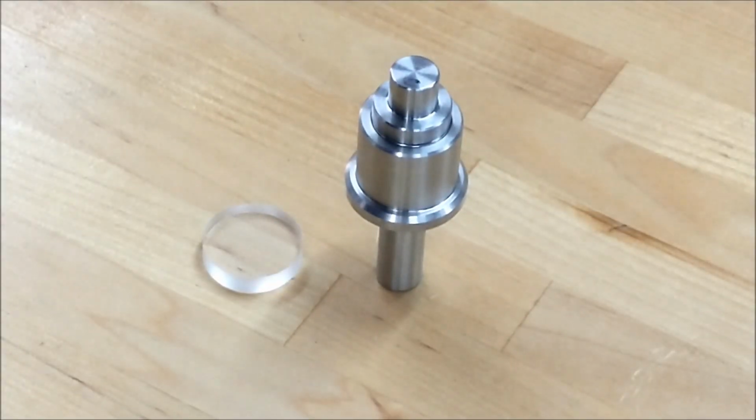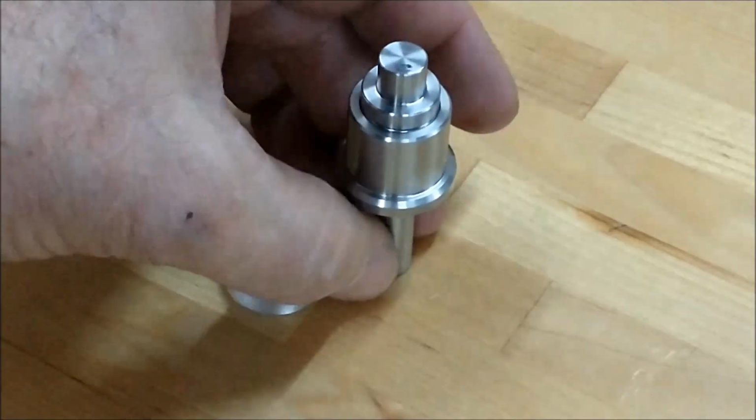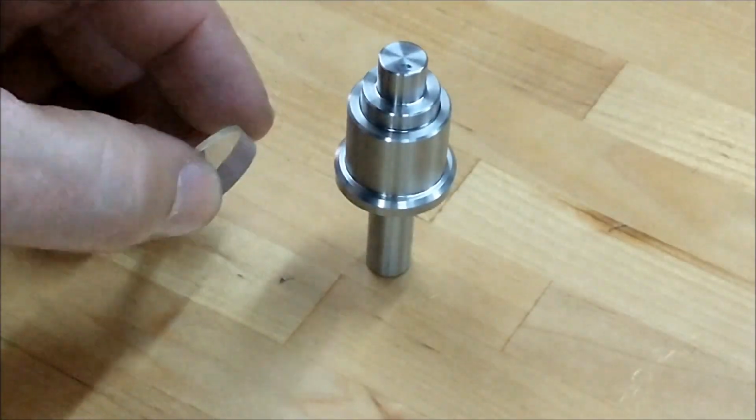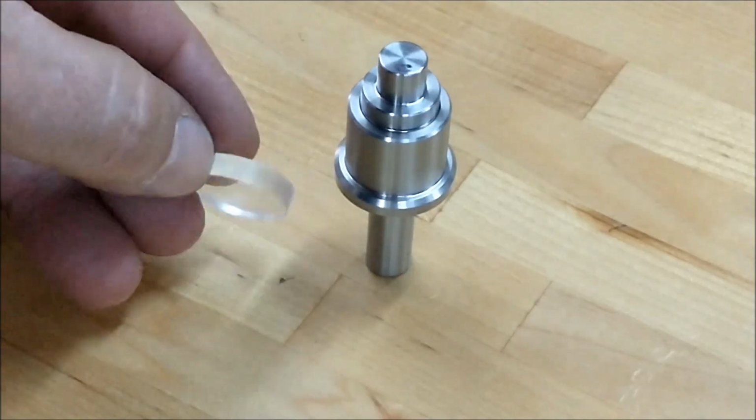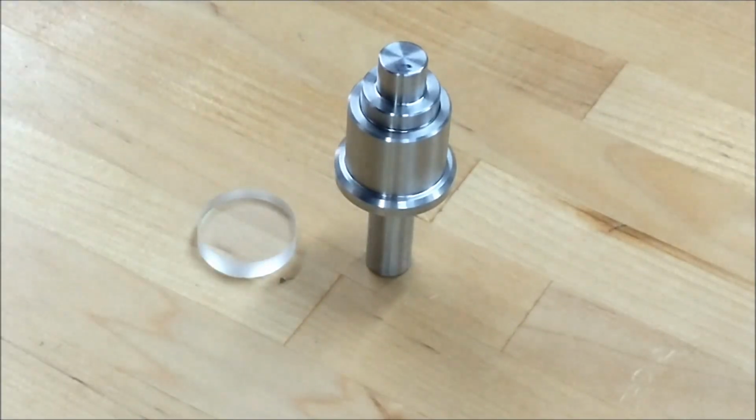I think it's plenty clear to see the utility of something like this. Turns your drill chuck into a live center pretty quick without goofing around, and the bearings are probably relatively inexpensive. And I'll tell you, when there's no other way to hold a piece or make a part that's going to be difficult, pressure turning it against a solid object is the way to go.